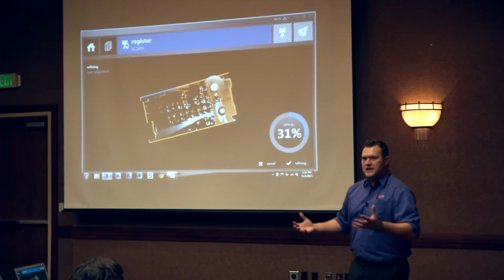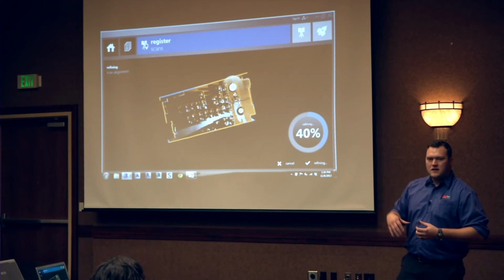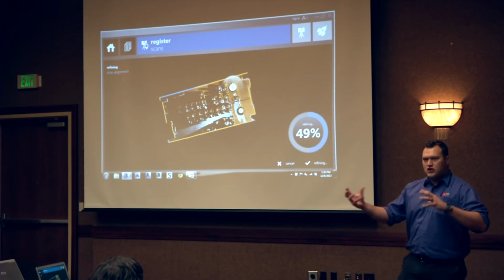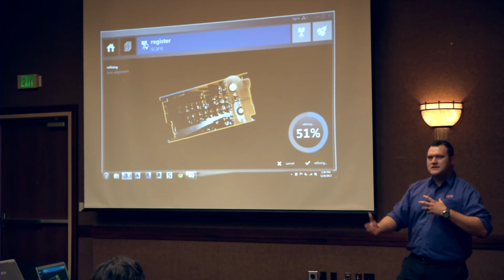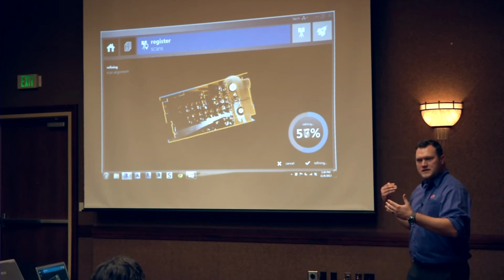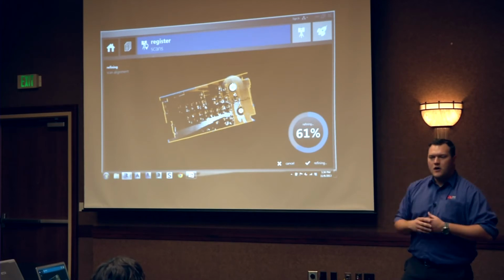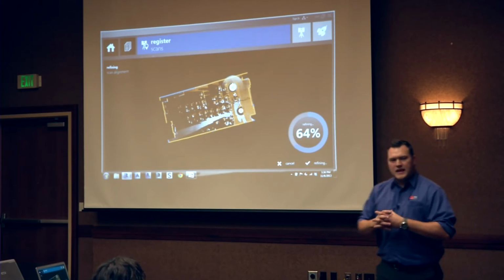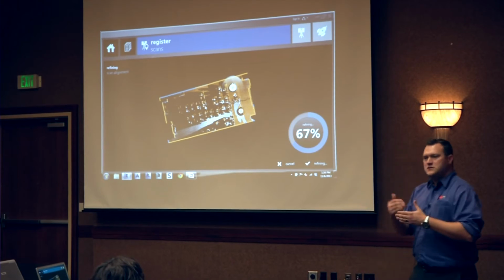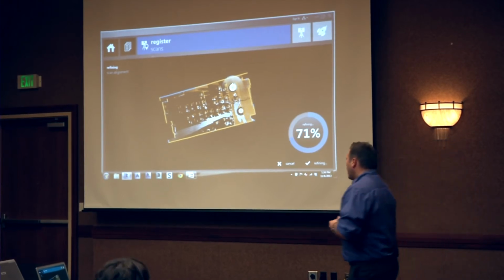So if you were going to scan this room plus the hallway out there, you'd want to scan at least four locations in here to get good coverage of everything and all the evidence. And then you do a scan in the doorway, so that way we're getting all the walls this way, and also the walls in the hallway. And then we do all our scans out in the hallway, so we call that a linker scan in the doorway or something. So we'd be able to traverse or leapfrog our way through the rooms,